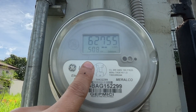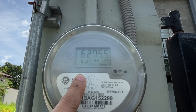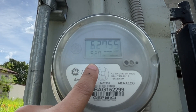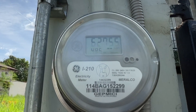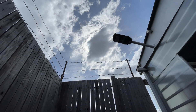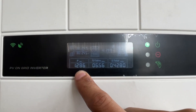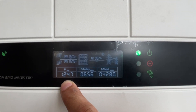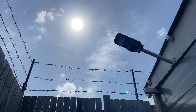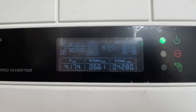Here at the meter we will see that our house is only consuming 0.5 kilowatts, when in fact our house is right now using a little above 4 kilowatts — so the solar system is subsidizing our consumption. This number fluctuates depending on the amount of clouds covering the sun. If clouds are blocking the sun, our system only produces 1 to 2 kilowatts and it can even go below 1 kilowatt if it's raining or if there is a storm. But if it's ultra sunny without clouds, the energy production can go as high as 4 to 5 kilowatts, which is the maximum that our system can offer.